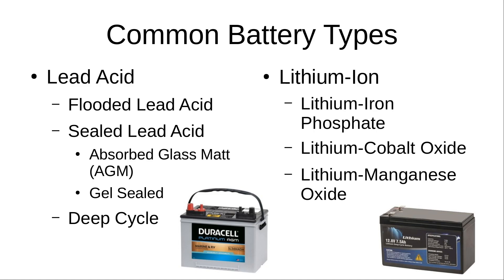The next type is the lithium cobalt oxide battery, referred to as an LCO or sometimes ICR battery. These are the batteries that typically come in consumer electronics like flashlights, cell phones, laptops, and cameras. They can be dangerous, especially when damaged — you saw that with cell phones blowing up on planes. Cobalt is also relatively rare, which makes these batteries more expensive, and they generally have a lower discharge rate, so they're not as capable of delivering high continuous current.